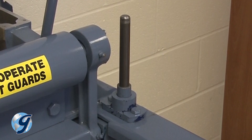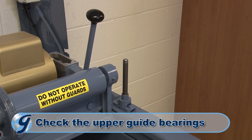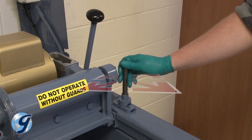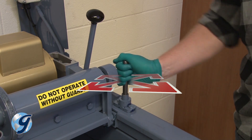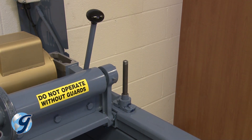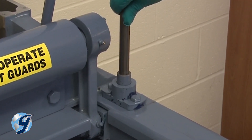To continue, on the upper end of the hydraulic clamp rod, check for worn guide bearings by applying pressure to the clamp rod with your hand, front to back and side to side. Just like we tested earlier with the cylinder, if the clamp rod can be moved more than 1/32 of an inch in any direction, you should replace worn guide bearings.